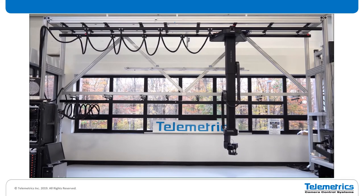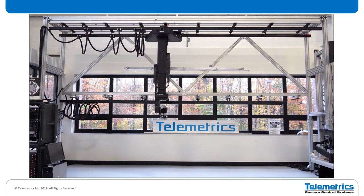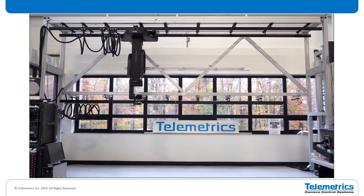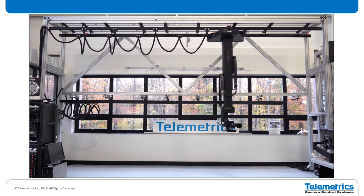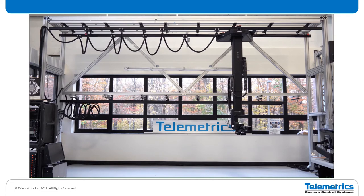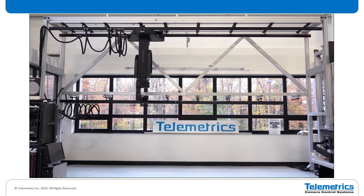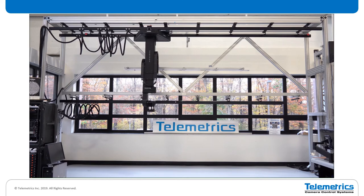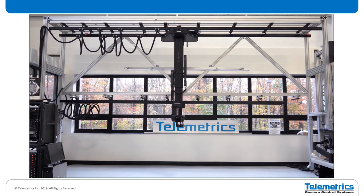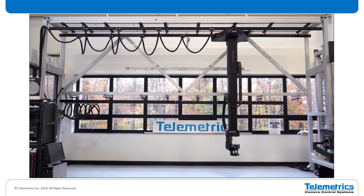Here's an example of our longest televator, the EP7-1000, on a ceiling track. As you can see, we're going along and there is a track joint in the middle of that track section — we are going over a joint between two track sections right there. We go down to about the windowsill, then back up, and this time with some panning on the pan tilt head, we go all the way down to the maximum full extension, which is about 11 and a half feet. If there were any issues with track integrity, you'd see quite a bit of pendulum effect at that extension. And as you can see, it's absolutely perfectly stable.